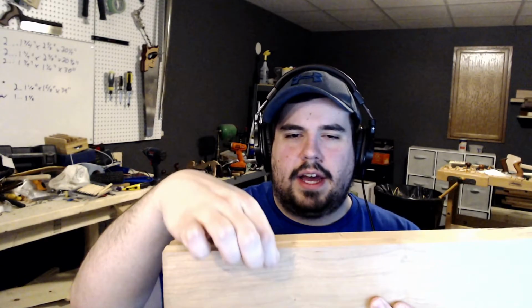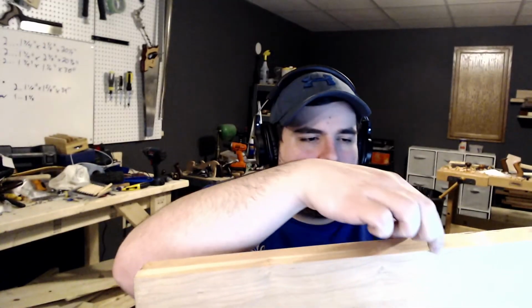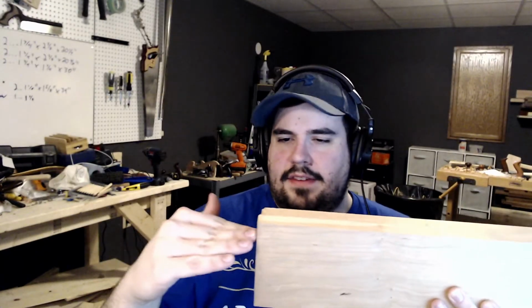and then just came at it from the side with the chisel, and honestly it takes like a tap, and this square will separate. You just fling it off, and then you can use a hand plane to clean it up at the very end. So excited to have one blank done.